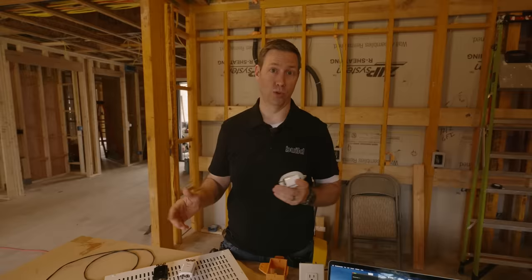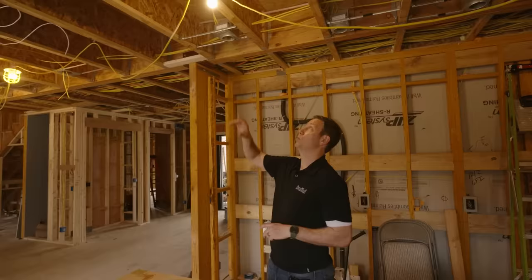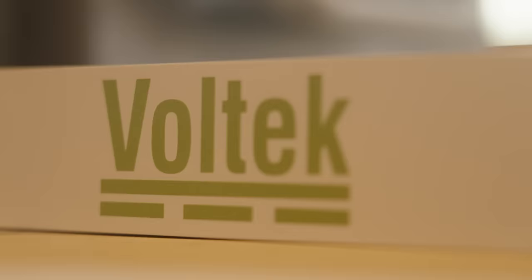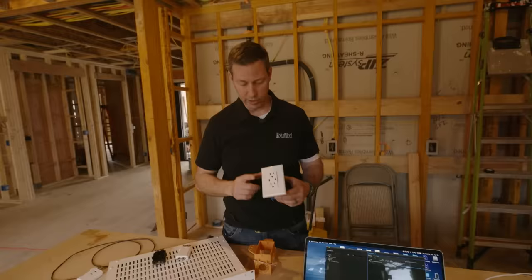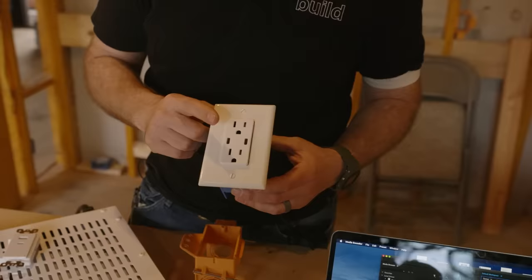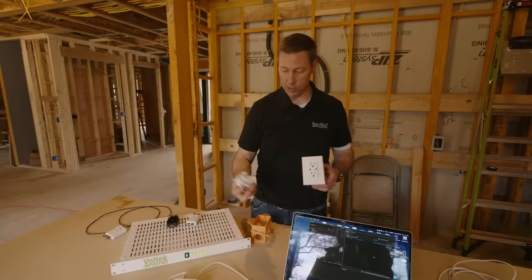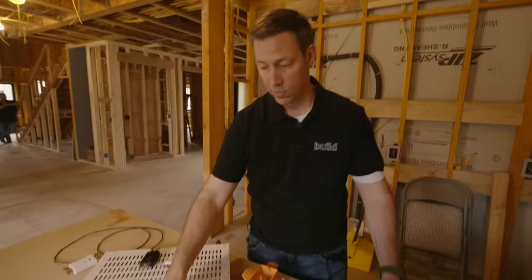When I published my high voltage electrical video, I wired my whole house in 12-2 so I could do 20-amp circuits, but several of you commented — and it really made me think — when I'm doing LED lighting, why do I need that fat 12-2 piece of copper? Right after that I found a company based out of Austin called Voltec. This is a regular 110 outlet that also has USB — this happens to be USB-C. I currently have several with USB-A ports, which are great for charging your GoPro, your phone, that sort of thing.